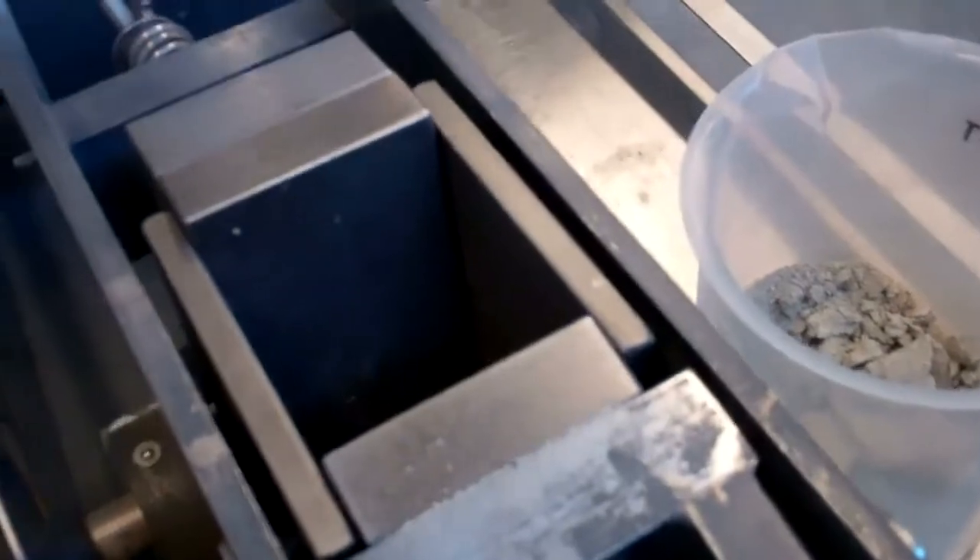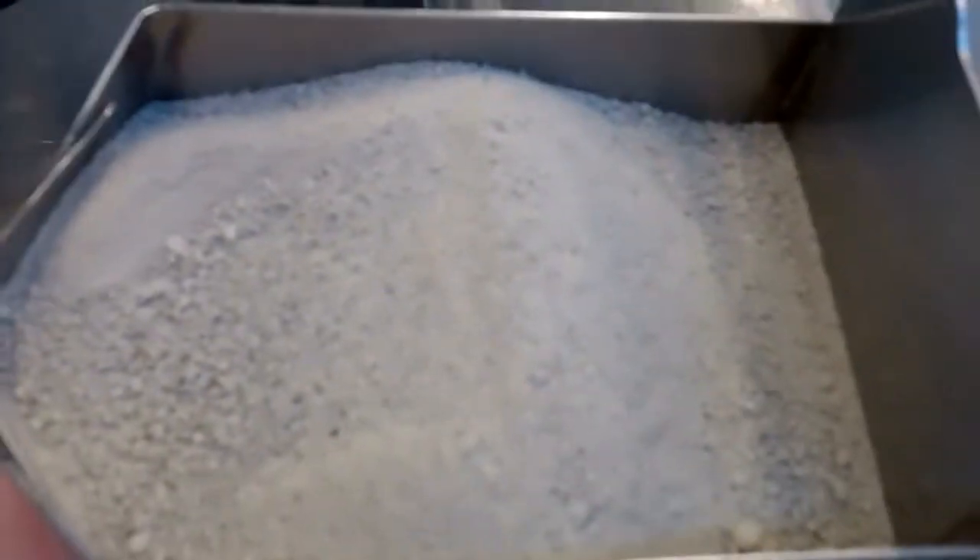So now we want to make them even smaller. So again, I'm going to make this opening smaller, then put them through one more time, get them smaller and smaller. I think you can see the pattern here. This is what came out of the final pass — the smallest we could make it in the jaw crusher. We had the two plates coming together as close as they possibly could to crush this, and it's very fine, which is exactly what we want.